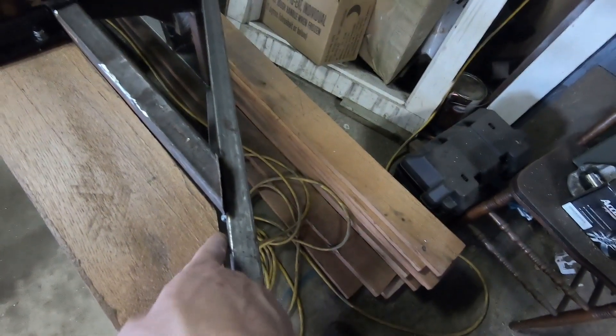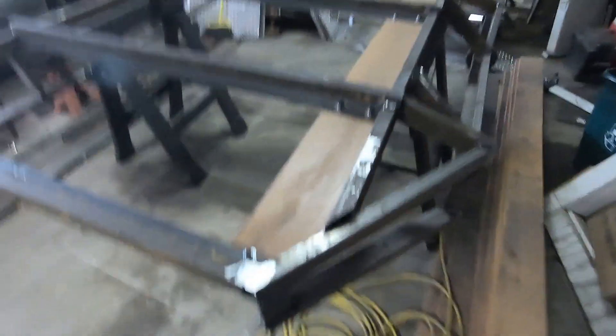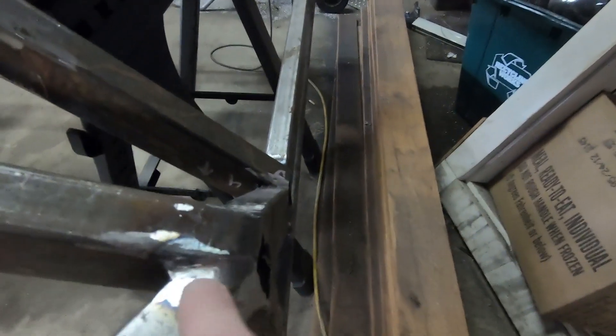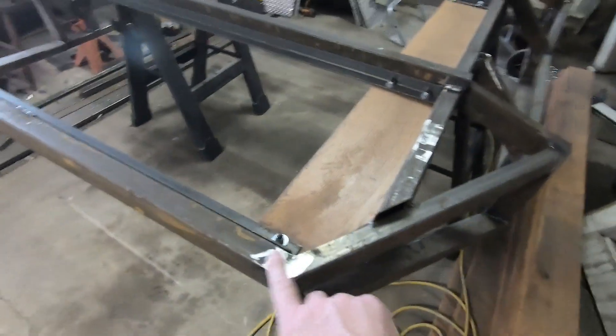As I was saying about the gaps for water drainage — I don't think anything I'm gonna haul will fall through there, so I'll leave that little gap for water to run out. I've been rounding off my welds to have nice rounded edges everywhere, so that once I put the raptor liner on, it'll be nice and smooth — you won't have smooth raptor liner with humps from the welds sticking up. I think it's going to turn out a lot better looking aesthetically that way.